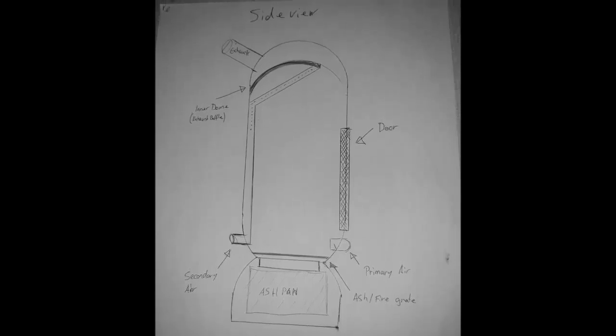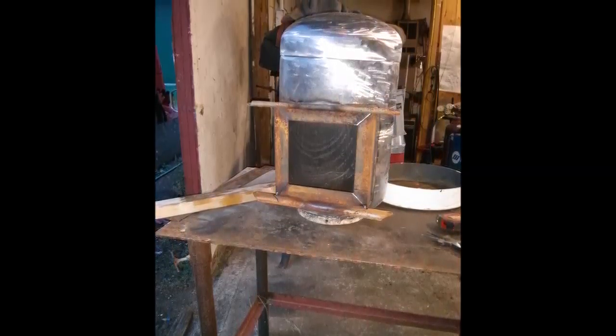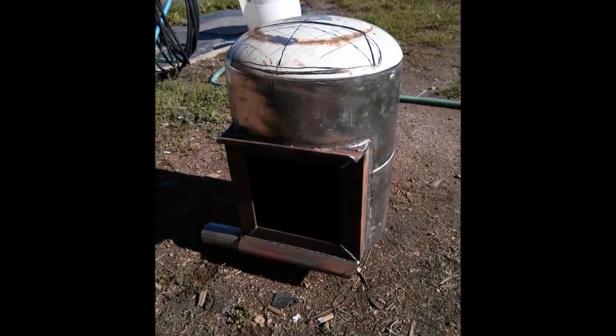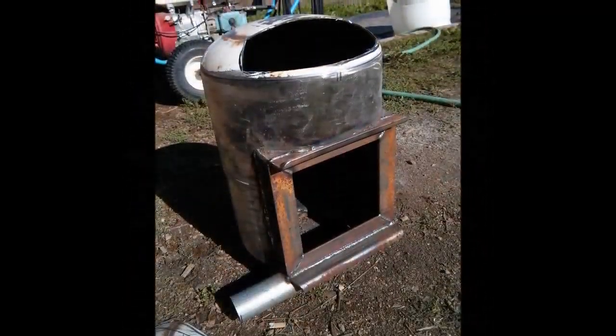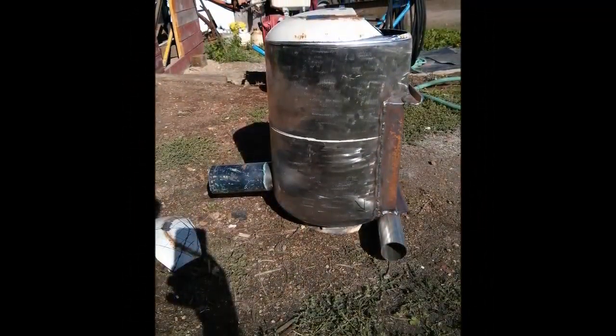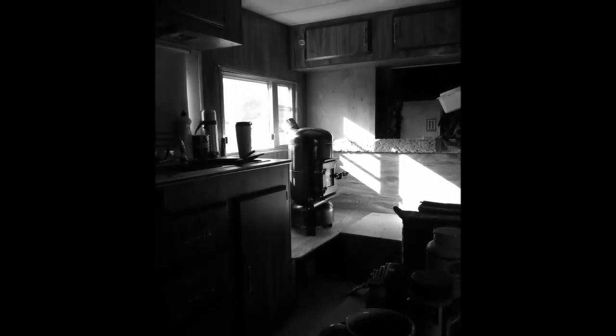The design pretty much worked out the way I wanted it to. The doors framed in, the top put in for the second smoke chamber, marked out for the cutout. On the bottom left of the tank you can see a pipe — that's the primary air intake. The back pipe is the secondary air intake; secondary air comes in at the bottom on the back and then goes up along the back wall and over along the top of the burn chamber, which makes for a clean secondary burn.